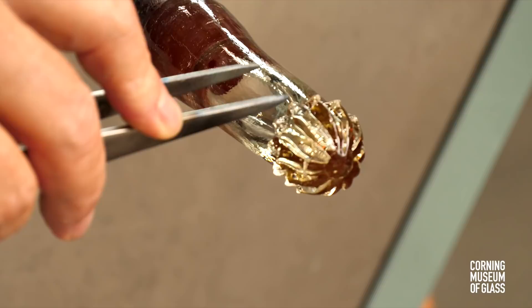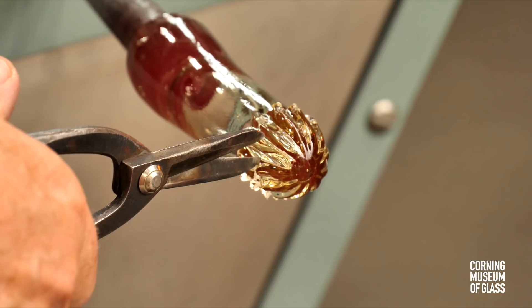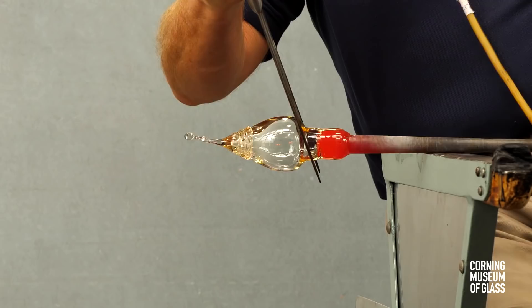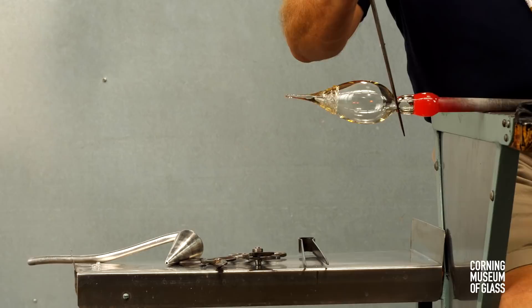There are two sets of snipped ribs. The glass is reheated and inflated. A constriction is begun near the blowpipe. The glass is spun to elongate the bubble, and blowing and tooling continue to create a narrow constriction near the blowpipe and to give the bubble its proper shape.